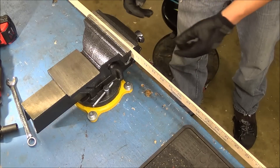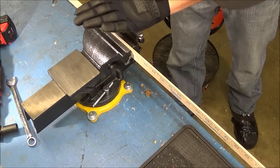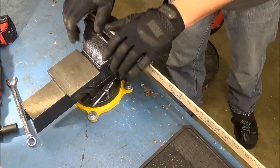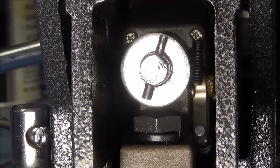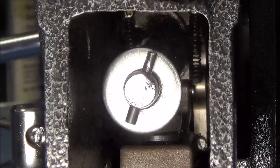It really is a single-hand quick-release vise and I'm pretty impressed with it already. We're going to put some different pieces of wood, metal, and other things in here to test that it's going to hold in place. Now let's look at how that quick-release mechanism actually works — it splits the nut that's holding the bolt. When you press the lever down, you can see it actuate, splitting the nut, which allows the shaft to move in or out very easily.